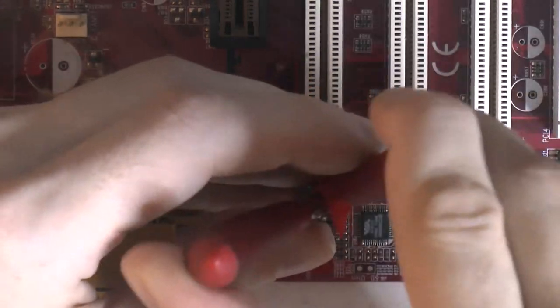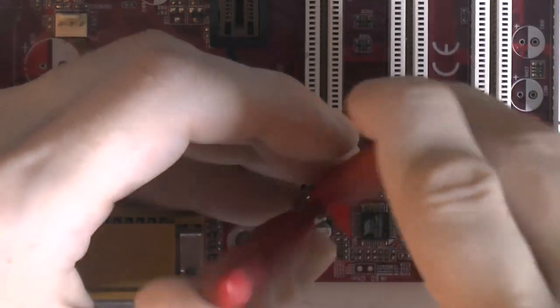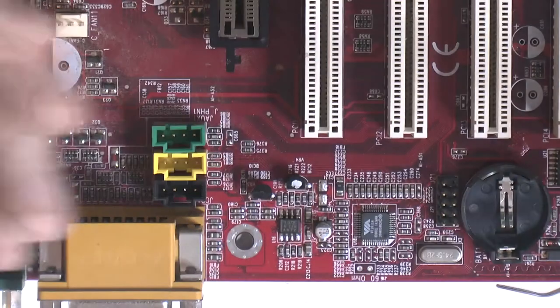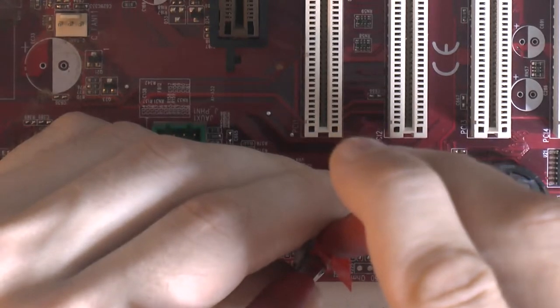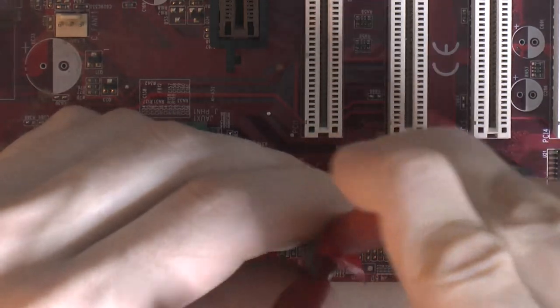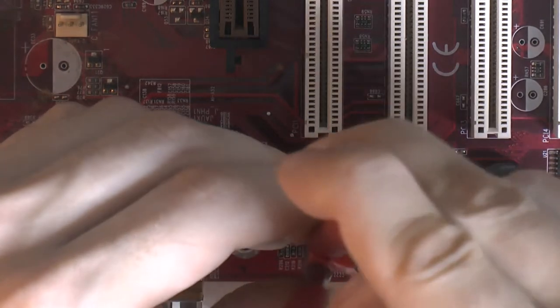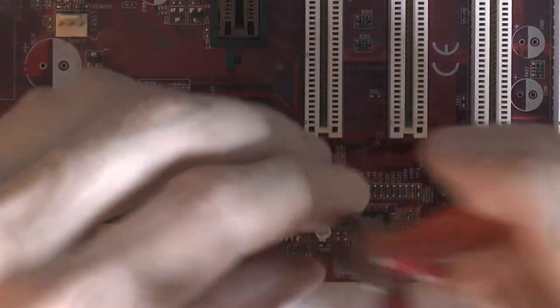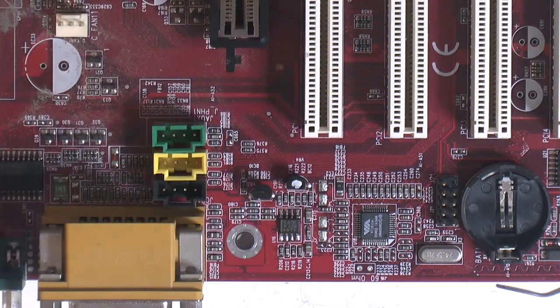And once you got them off, obviously, you just clean it up with your soldering iron. You get what's left of the legs off the pads, and you clean the pads with your wick. So, very easy. Some caps go off in one or two small twists, other ones need like 30. And like I said, some people just twist them 180. I'd rather take my time since I often repair other people's stuff and I really don't feel like ripping the pads and having to repair them. So I'd rather take some extra time than having to spend time later. This one has gone on one side and then the other side.